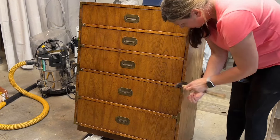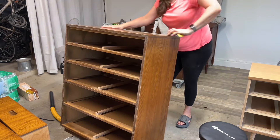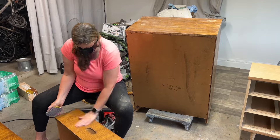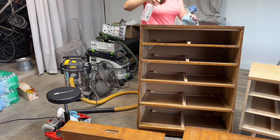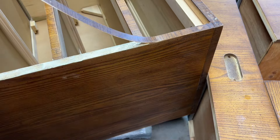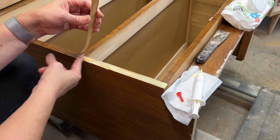So I'm going to take all the hardware off because I have to go ahead and do the same protocol where I polish it all up. This one I felt I could do a gentle restoration on. For that, you need to scuff sand — I like to scuff sand at about 180 — then clean it with a 50/50 mixture of denatured alcohol and water, and then you can simply apply gel stain. Because gel stain sits on top of the wood, it doesn't penetrate it. I did have a few repairs to do — I had a lot of veneer that was loose, so I re-glued all of the veneer, and had a little bit of damage I had to come back with some Quick Wood to repair along the base.